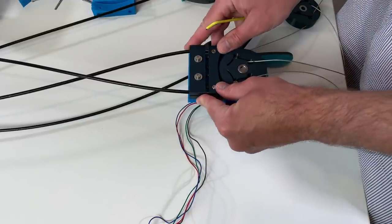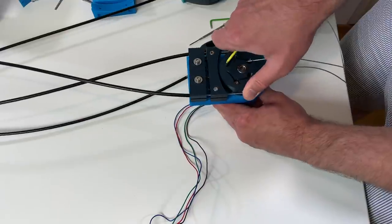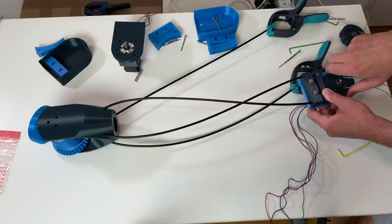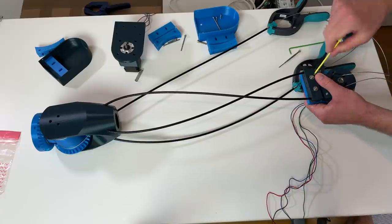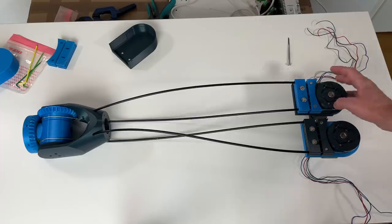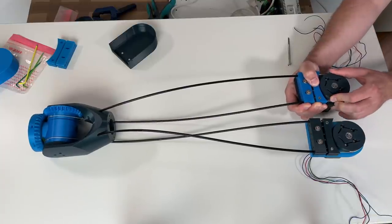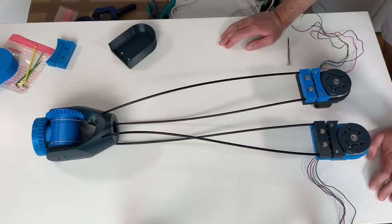This entire system with the springs does not work perfectly well. When I try to rotate the pulley, the entire block moves and there is a lot of friction in the system. It works, but I need to apply an enormous amount of force. Releasing the tension from the screws makes everything even worse. I assembled the second stepper with the pulley and this time put extra grease and lubricant inside the Bowden tubes, hoping it would reduce friction — but the friction is still very high. The lubricant made no difference because the initial cables were already pre-lubricated.